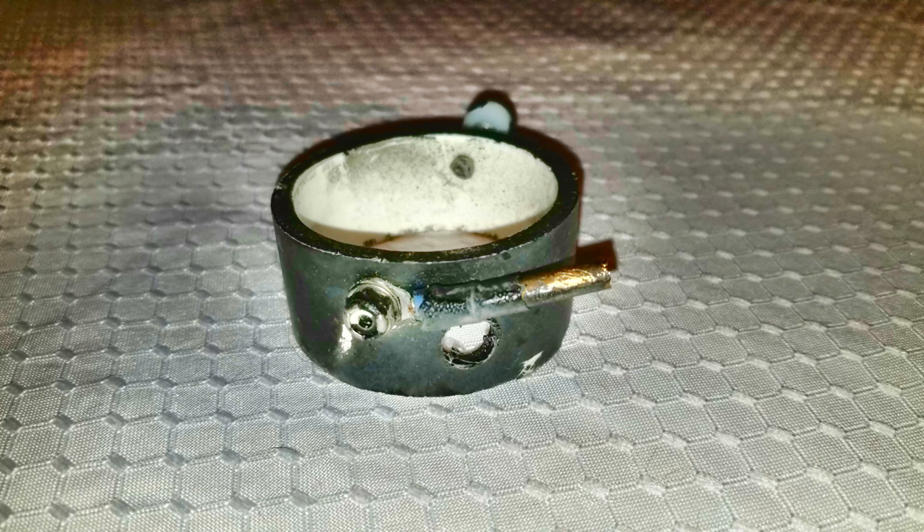I've got the new pickups, I'm going to be cleaning up everything and cleaning up all the contacts, and redoing the paint job going with a red color scheme. I've also got the dual collar system, which is an upgrade they offer. The original Wolf River Coils came with a single collar — I still have the original single collar. I upgraded to the dual collar, which is nice because you can basically pre-configure two settings. I was using 20 and 40 meters, so I had each collar set up on each one of those, and I could just move that jumper wire from one to the other.